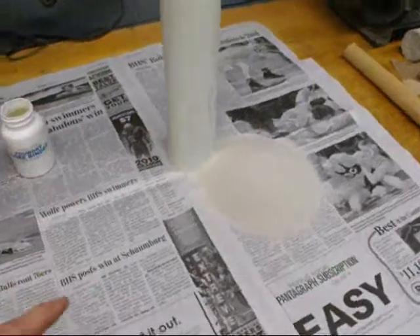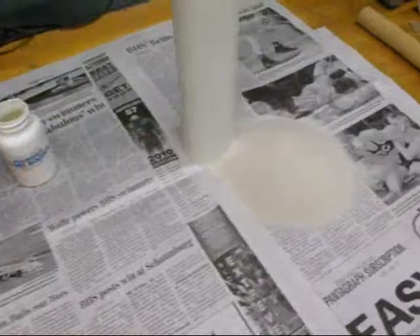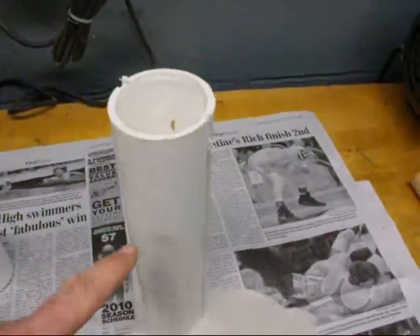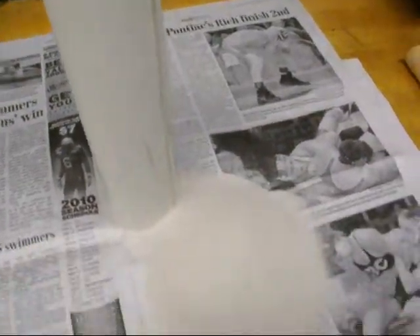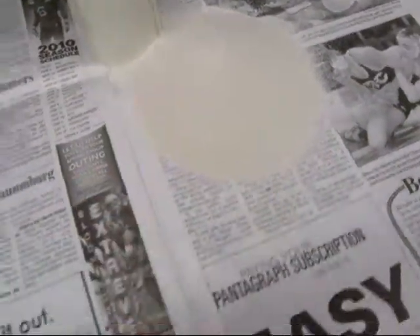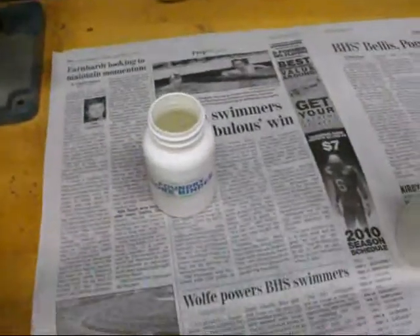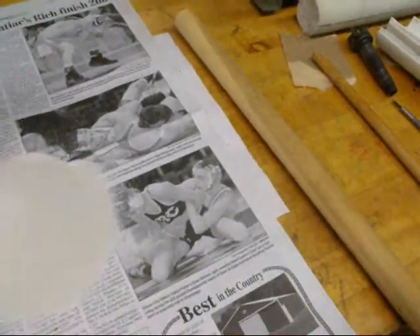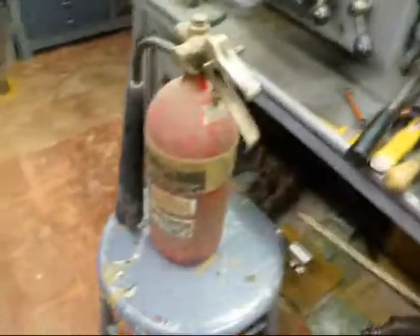What we have here is silica sand from Illinois. I've filled up the core box — this piece of pipe — to the top with sand, and I've got a little extra down here. We're working on double or triple newspaper so it's easy to clean up. We've got the water glass, we've got a dowel to ram it down, and that's all there is to it except we need CO2.